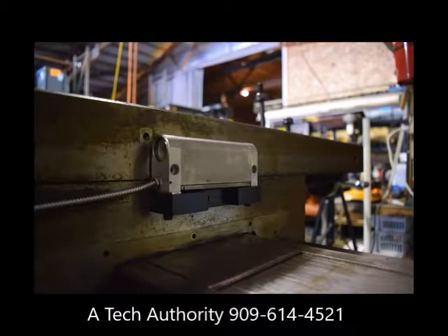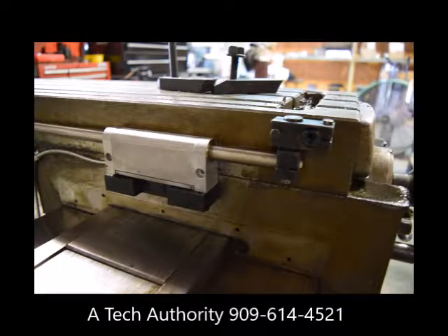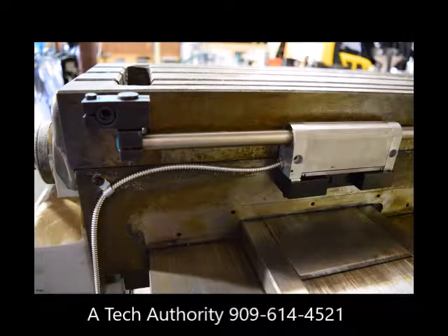For the X axis, I mounted the reader head again on the saddle using the bracket kit provided. Don't forget to indicate the reader head in both parallel planes so that it follows the machine's travel. Traverse the table to its most negative position and repeat the same process as before on the Y axis to attach this side's support assembly. Position the table to its most positive position and again run through the same process as before, making sure that the scale is able to slide through each support link with ease.